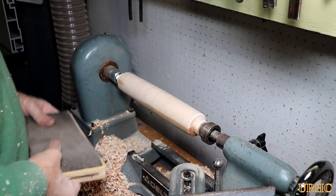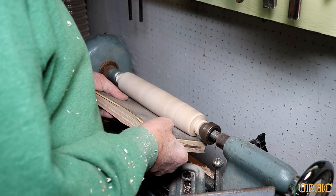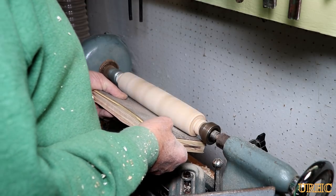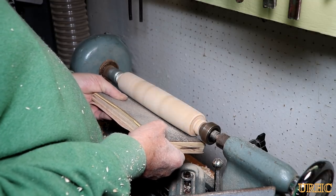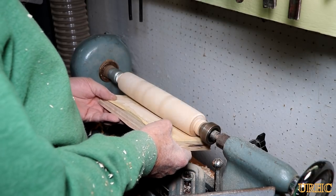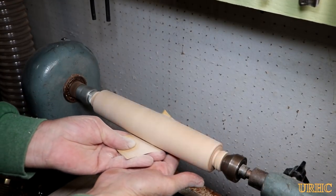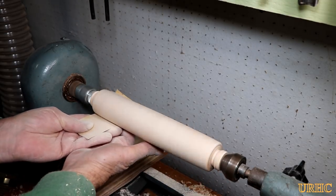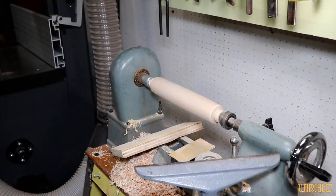For these rolling pins I take a block of flat plywood and just hold sandpaper on it. That really helps me do a little bit of rocking on there so I can kind of shape it to be just about perfect without any flat spots. So the piece of plywood with some real coarse paper on it first helps me clean it up and get it the proper shape. Then it's just a matter of continuing down with finer and finer grits of sandpaper, watching for any streaks and marks from the sandpaper to disappear before you go down to the next grit.